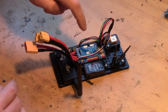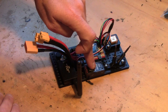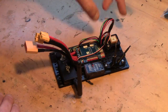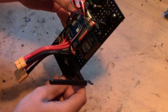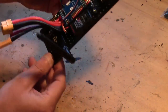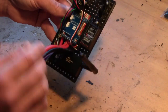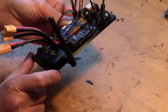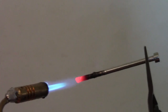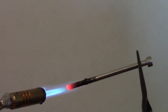I've got the electronics ready to go. I'm using a Matek H743 Wing autopilot, a Futaba receiver with diversity antennas, GPS and compass, a telemetry radio, USB connection, and speaker for the flight controller. I mount all of this on a little 3D printed breadboard that fits neatly in the back of the X8. That way, if you need to rewire things or change things, you can just undo a couple of screws and remove the whole thing. For mounting bolts through the foam body, I just heat up an M3 bolt and it'll nicely pierce through the foam.